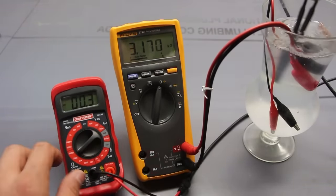And that happens a lot with car batteries. Say 20 volts, and again line this up, and I'm getting 1.62 volts roughly. Now I want to move it to the 1.5 volt and see if I get any different reading on that. So I'm getting 1.555 volts. Alright, to make sure it's not me, I'm going to switch it back. So there seems to be a little bit of a difference. Barely, so potentially it could be putting a small load just to get maybe a bit more of an accurate reading. So all of this basically means that this battery should be good to go.